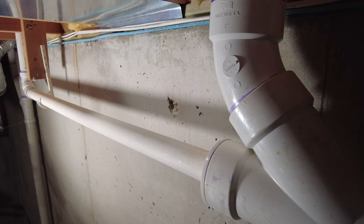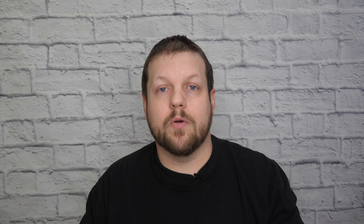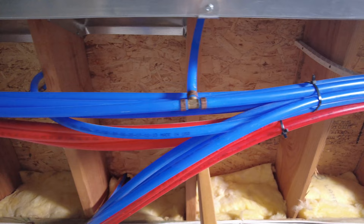The key things are: you have to have access to a water supply line to get water into the reverse osmosis system, and you have to have access to a drain. If you're not installing this underneath your sink, you won't be able to use the included adapter that taps off the faucet supply. You'll have to tap into a cold water supply line at your installation location. Make sure you're tapping into a cold water line — if you tap into a hot water supply line, you'll ruin your reverse osmosis system and damage the membrane.